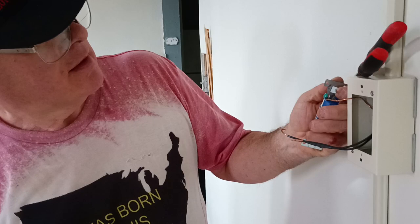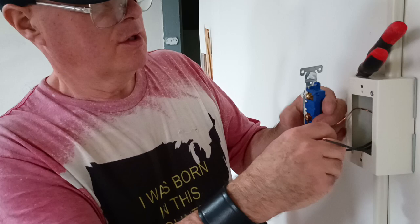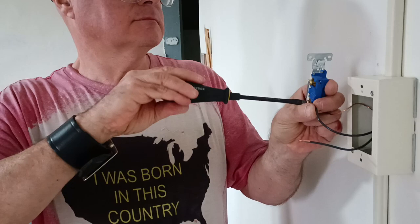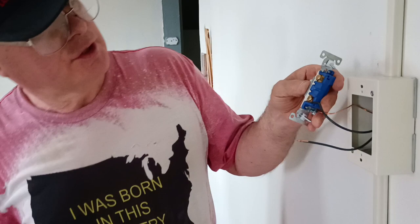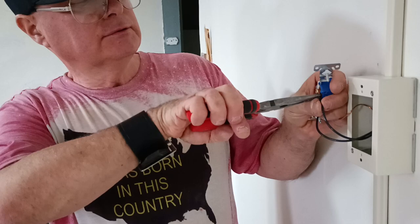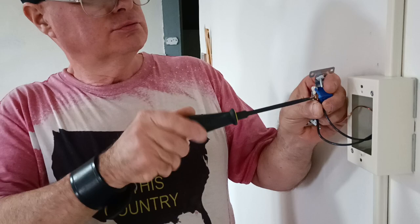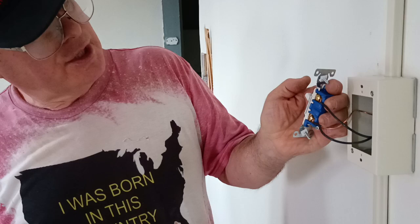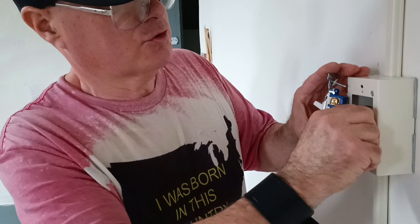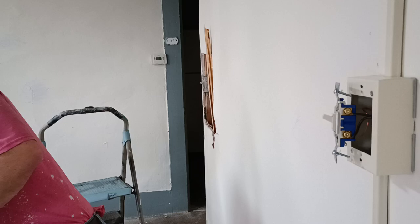Now we'll flip it down this way. It doesn't matter which of the two wires goes on each screw. Close our loop. Make sure it's nice and tight like that. Get our other one up here. It's tight and our connections look like that there. Now we'll fold our wires to go into our box. Make sure our wires don't get pinched by our screw when we fasten our screws down here. Look, make sure our screws aren't going to hit the wires.